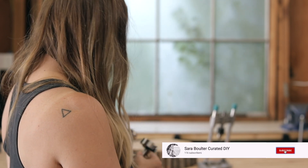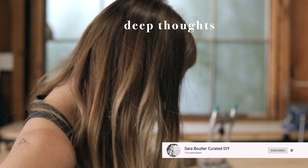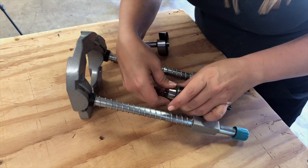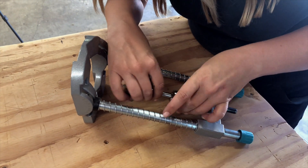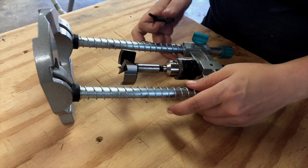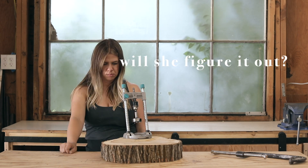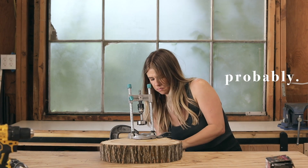This part of the project is what I like to call Sarah meets a new tool for the first time and stares at it until she figures out how to use it. This is called an angle guide, and I used it to get a perfect straight angle on the holes where the legs go, so the legs aren't just straight up and down when finished. I legit just stared at it until I knew how I was going to use it. I knew I needed to secure it to the pine so it wouldn't move while drilling, and I settled on clamping it, but later decided to screw it into the wood itself to keep it steady.